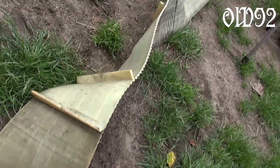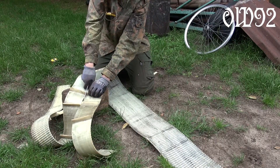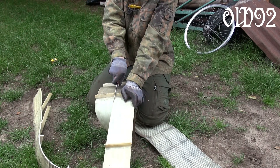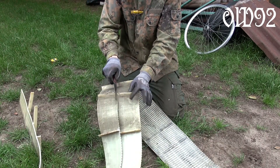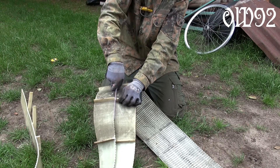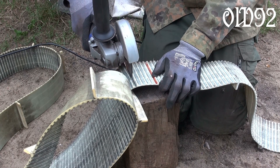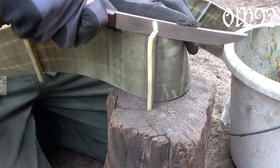As the base material I'm using an old 20cm wide conveyor belt — I don't know where it came from. For my tracks I just need one half, so 10cm. Luckily the whole belt is already separated; the only connection are the rubber shovels which I have to cut. That conveyor belt isn't just rubber — inside there are groups of steel wire, so cutting with the angle grinder is the only option.